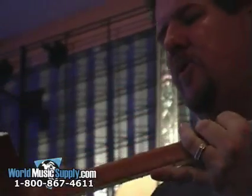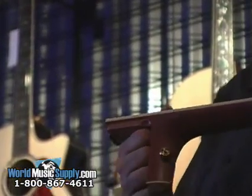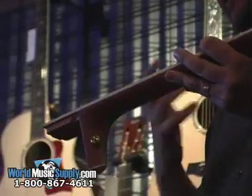Now by putting meat on the back of the fretboard, we don't glue the fretboard to the top. We got rid of that part of the flex of the neck. So it's real stable, no more 14th fret neck hump.